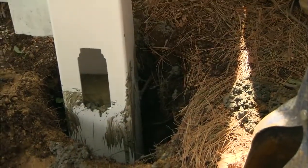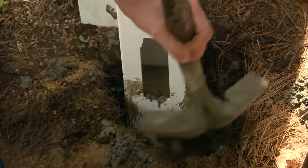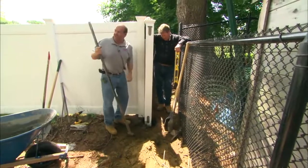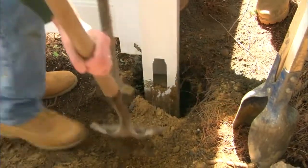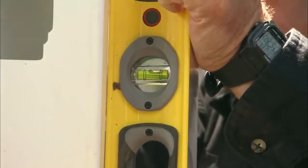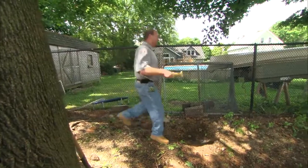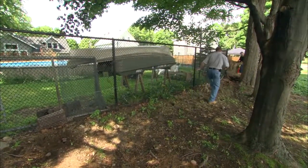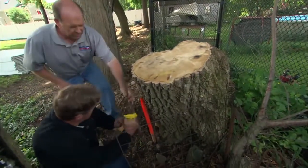We're going to put about a foot of concrete into the hole and then tamp the rest in. I'll compact the concrete, then add the material we took out. Make sure we're still plumb — we're good. I'm going to run a string line the whole back run here to give us a point to plumb our posts to, running it right to the property line.